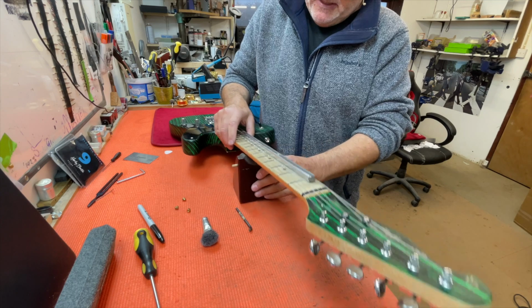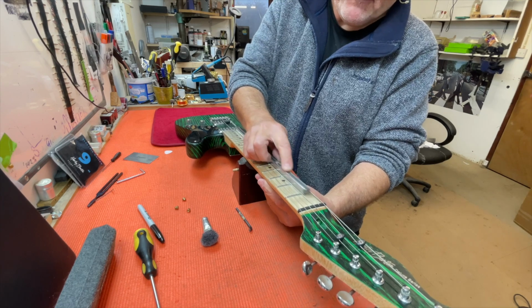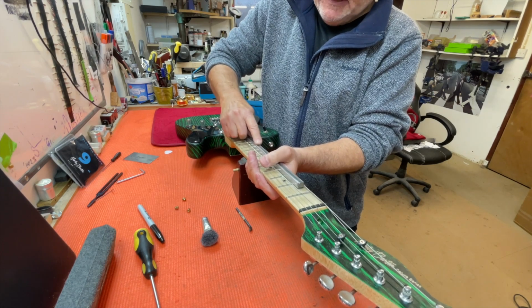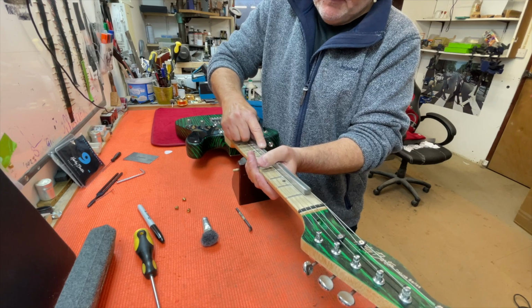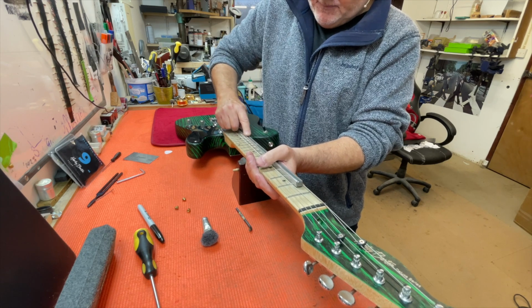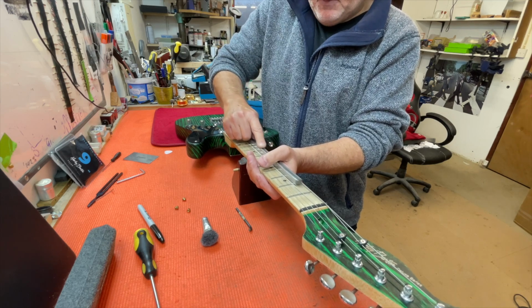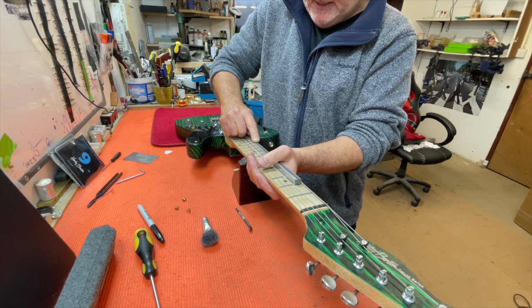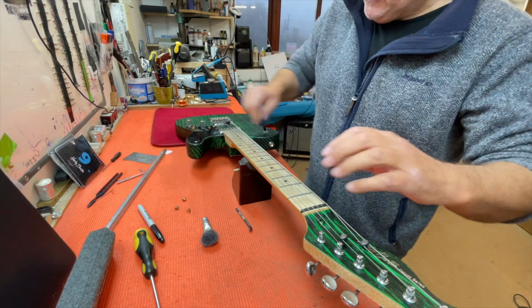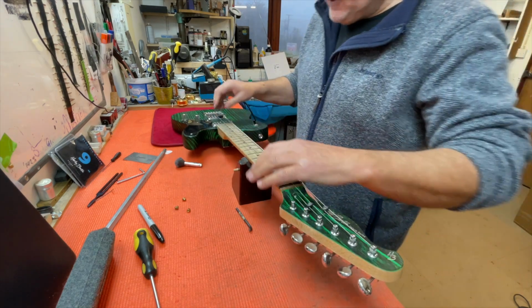So now at this point in the neck, I'm leveling for what I call fret slap, as opposed to any uneven frets, individual uneven frets. So I'm trying to allow the natural curve of this leveling beam to sort of impose itself on the topography of the neck, which is actually a little bit up and down, as you heard me referencing some low and high spots. It's those little variations that make it a little bit difficult, or it makes the strings clatter on the frets. There isn't quite enough room for them to move.